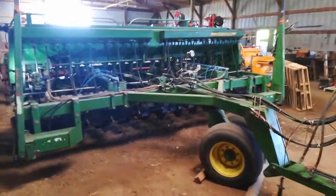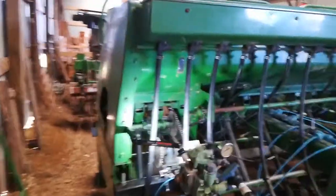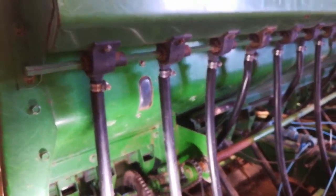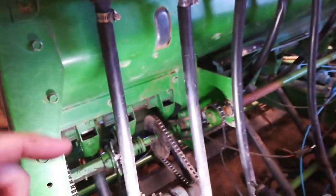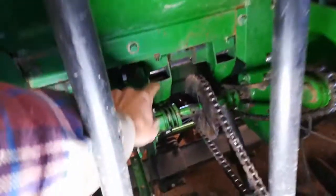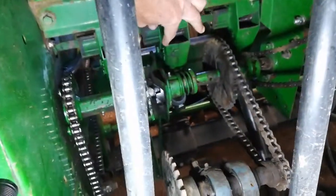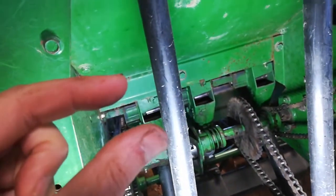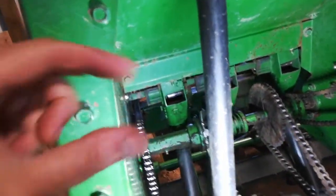Time for another little video showing some of my issues with the 750 grain drill. Normally when I put the main seeding rate on I have no problems, but when it comes to cover crops where there's a small amount of seeds per acre going down in terms of weight, I have to really adjust these seed cups. The cups are this width here on the row and go in and out depending on how I move this lever. When it gets too narrow the seeds start to pile up and don't flow easily.